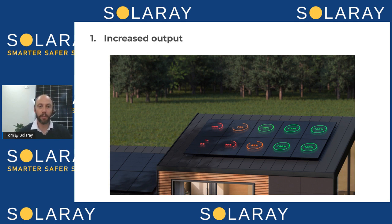This is true at any one time with shade, but also over time, because panels actually drop off in output over their lifespan. The warranty is normally somewhere between 80 to 90% of the original output after 25 years — the better ones up around 90% and standard ones around 80%. Because they degrade at different rates, Enphase microinverters allow you to get maximum output from each panel as they drop off over time.